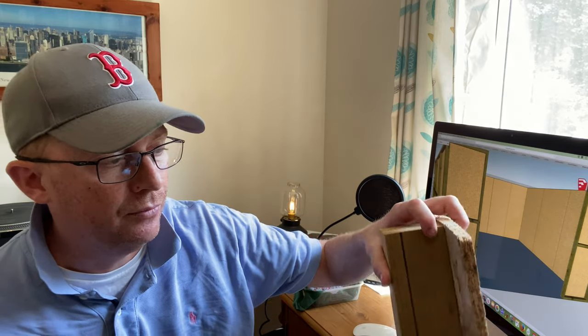There will be an air gap between the insulation and the exterior wall, and I'm planning on wrapping the whole thing in Tyvek before applying the exterior cladding. I haven't decided on the cladding yet because I've still got the guys at Reclaimed Timber Liverpool who are trying to source me something. They've got various ideas they're coming up with, so I haven't decided what the external cladding's going to be yet. So I have got the internal board, the 50 mil insulation, an air gap. It will have a wrap of the Tyvek around it, and then the exterior cladding. But I'm just a little bit worried that on the inside, as I've just said, it won't be sealed with aluminium foil.